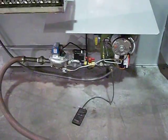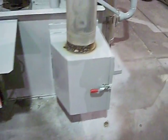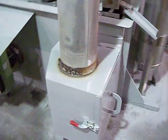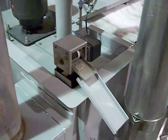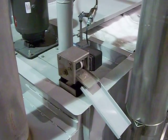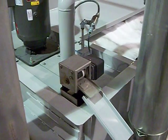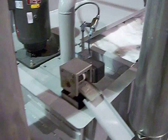The heater is located down below the conveyor system. Next to the heater you'll notice there's a burn-off box — that is where you can place sludge to have it burned off. The skimmer, when the timer is set as we covered a moment ago, can be set to run early in the morning prior to operation, and the machine will remove and skim oil off the top of the tanks.